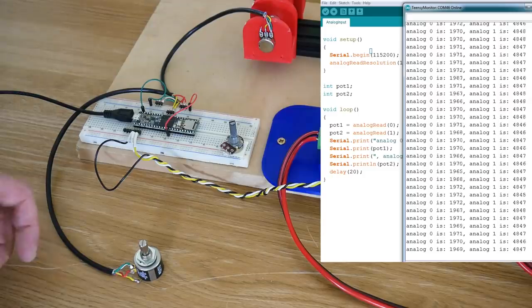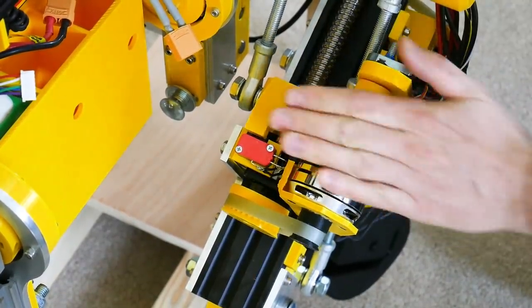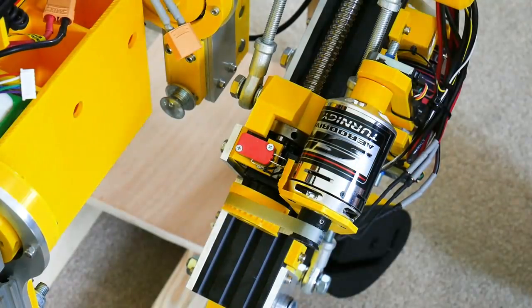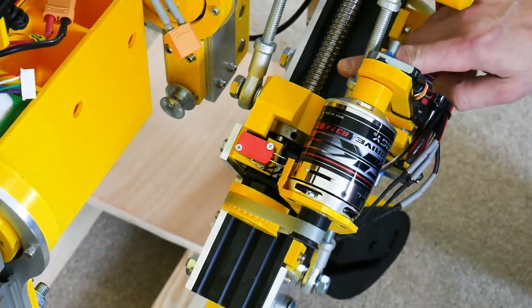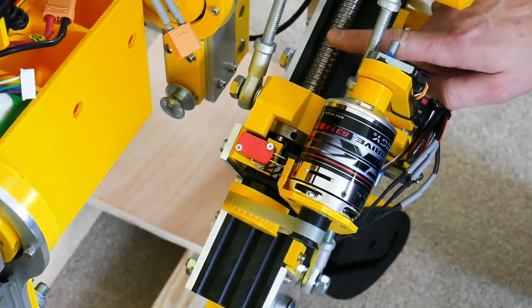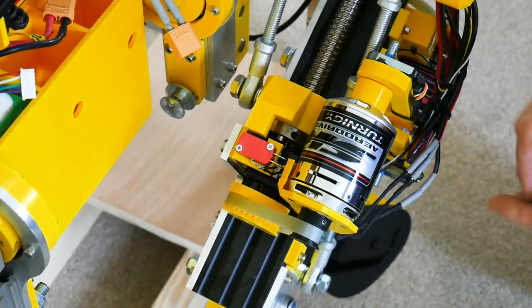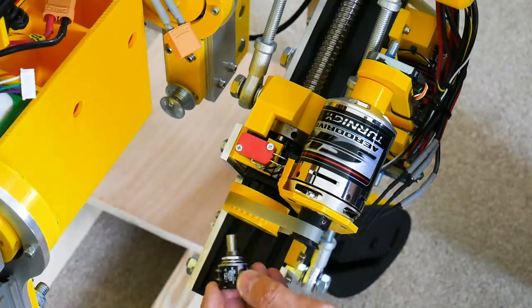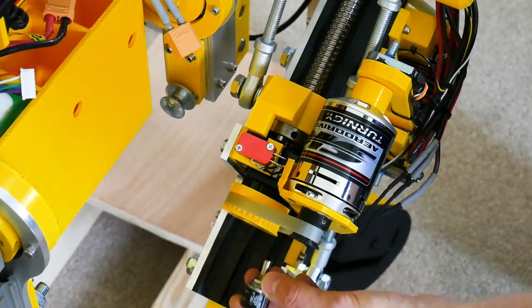We could take a running average or something like that, though it might be less accurate. But if we only use it on power-up, is it more or less accurate with the filter than hitting a micro switch? The current homing solution is this micro switch and a block - as the ball screw gets to the end it hits the micro switch. We could put a 10-turn pot on the ball screw, but the ball screws are 16.05 - 16 millimeters diameter and 5mm thread pitch - so each rotation moves it 5 millimeters. With a 10-turn pot we could only measure 50 millimeters of travel. To cover the full length we'd need to gear it down about 3-to-1, giving 150mm of travel. A proper linear pot like in capacitive calipers would be accurate, but they're very expensive and I need 12 axes.